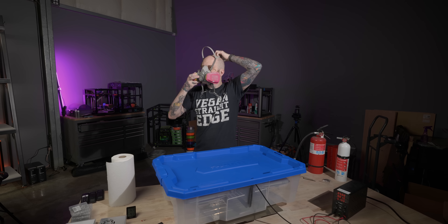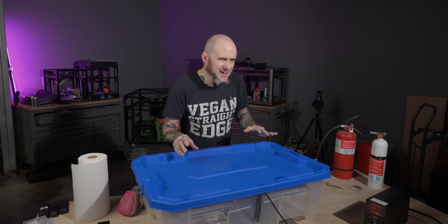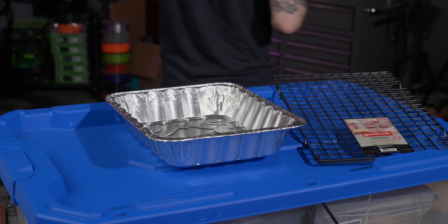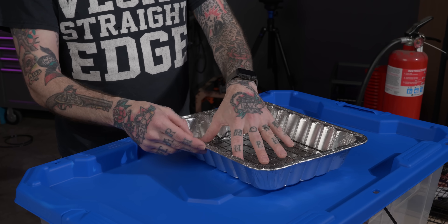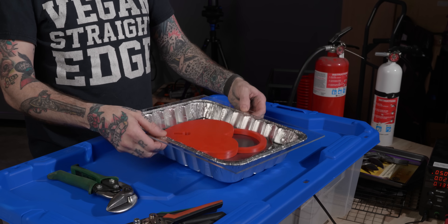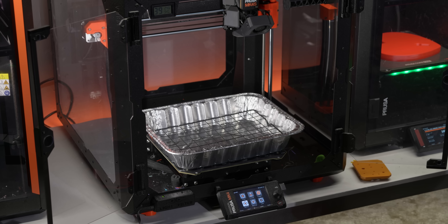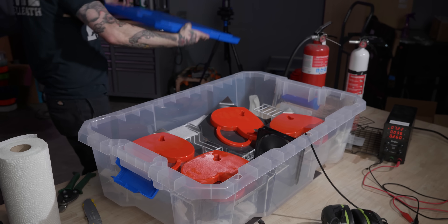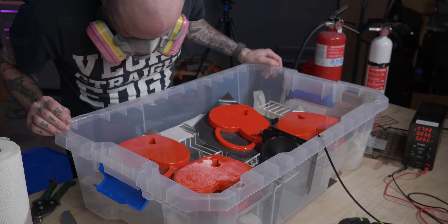But this isn't working. After an embarrassing number of hours, I've got two fully smoothed, two halfway there, and way too many still to go. I need to approach this from a different direction. I ran to the store and grabbed some cheap aluminum baking trays — I need to reduce the volume of space that fills with acetone vapor so these smooth much faster. I also have to continue with the active heating, meaning I'm going to slap these onto the print bed of my Prusa XL. The smaller chambers fill up with vapor faster, but they were hard to control, so I did continue using the bigger chamber just with more hearts in it. In the end, I didn't get as many smoothed as I'd like — it's just taking too long. We need to get this project done.